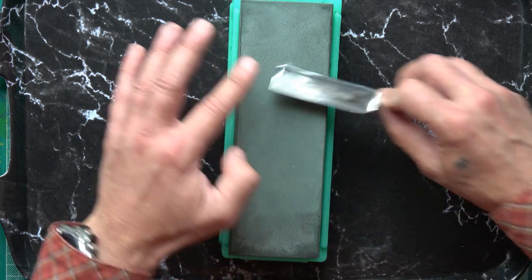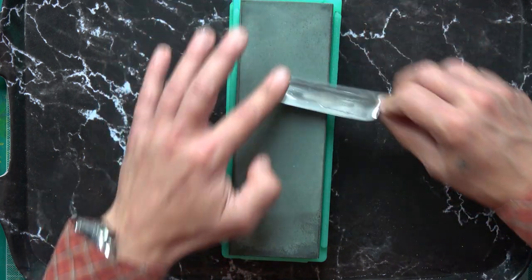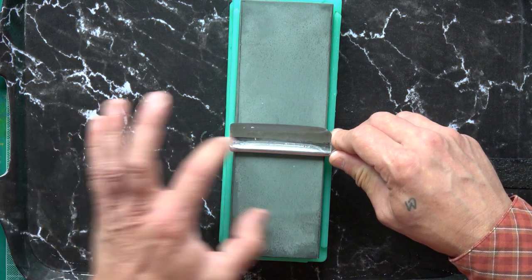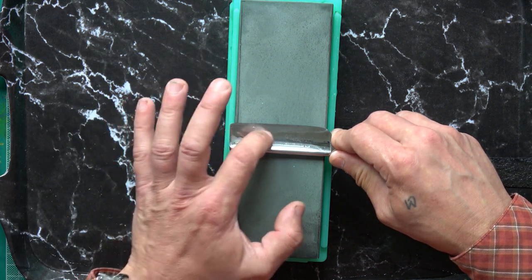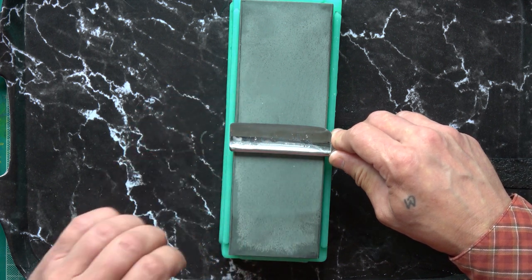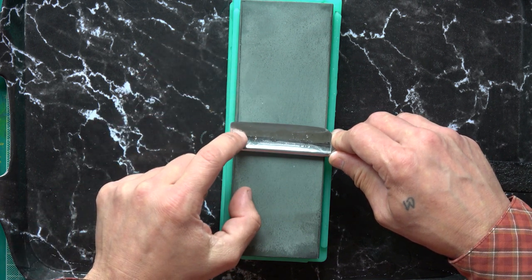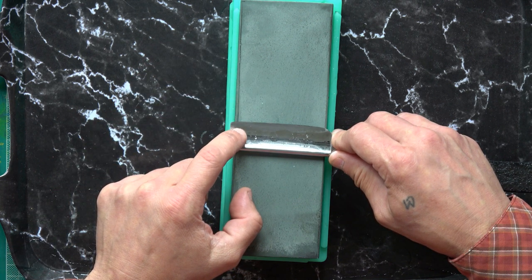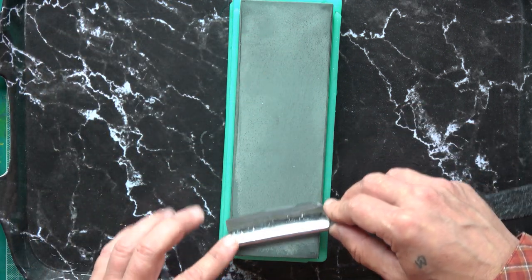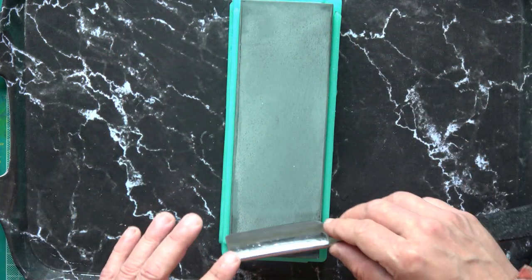Because you've got to try and picture what's going on, haven't you, with your pressures and stuff. So if you got a razor, I'm not touching it with the edge, but if I started pressing too much on any part of the razor, what's happening is you're curling the metal. So especially if you start pushing it there, you're almost creating like a bow in the profile of the razor. So you're actually honing behind the very apex of the edge.